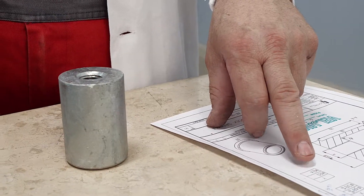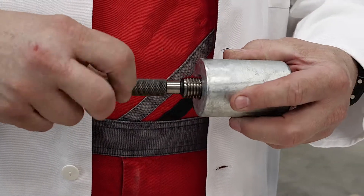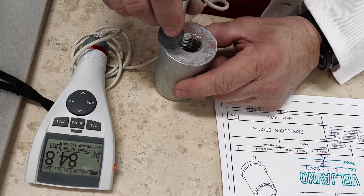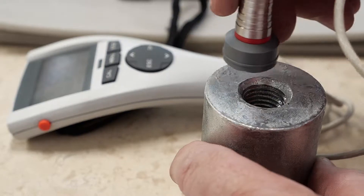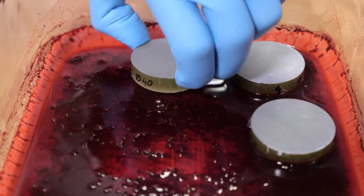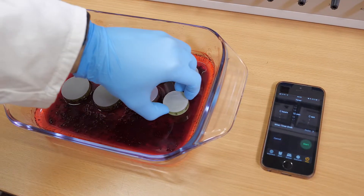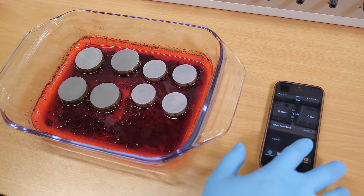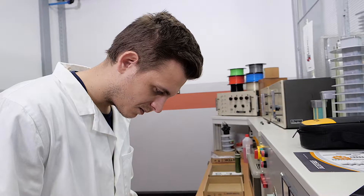The quality of the end product is ensured with initial, mid-process, and end-phase material and product quality control. The surface of the bottom end fitting, protected through the process of hot dip galvanizing, is checked. Epoxy rods, resistant to electrical corrosion, are tested for dye penetration. If there are signs of dye penetration on the surface after 15 minutes, we return the shipment.